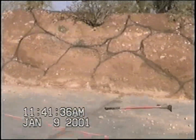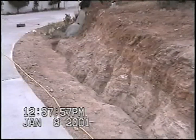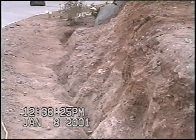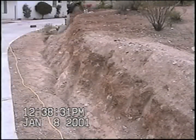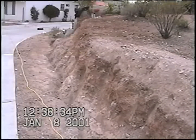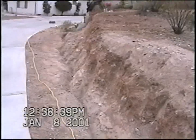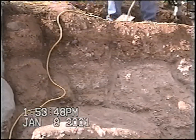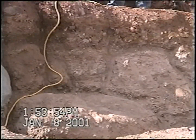The first thing we do is start out by spray painting the boulder shapes we want to excavate. From there, we dig a trench all along the base of the rock wall to get the rock into the soil so you never see an unfinished edge — it's not so much a foundation, it's just bringing the rock down into the ground. Then we dig out between each boulder to create the joints and pop the bank to get some definition started.